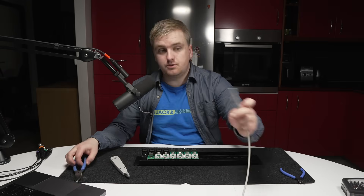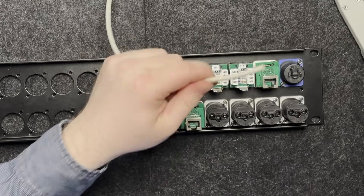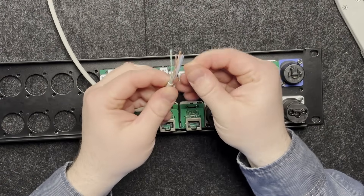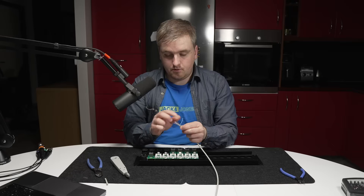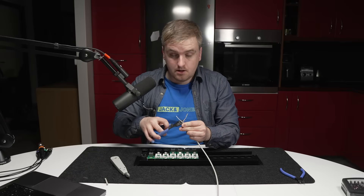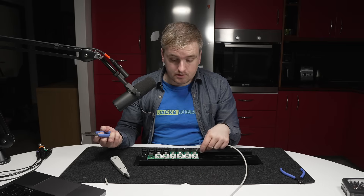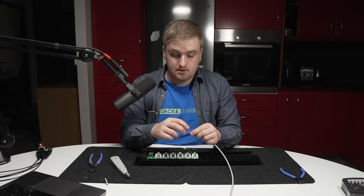Normally you would be using these with CAT5 or 6 cables. You just take the outer plastic off and you can see it has the 4 pairs of cables. Normally I would just patch this into the connectors. Everyone in Europe seems to be using the B wiring pinouts and that is what I have always been taught to use.